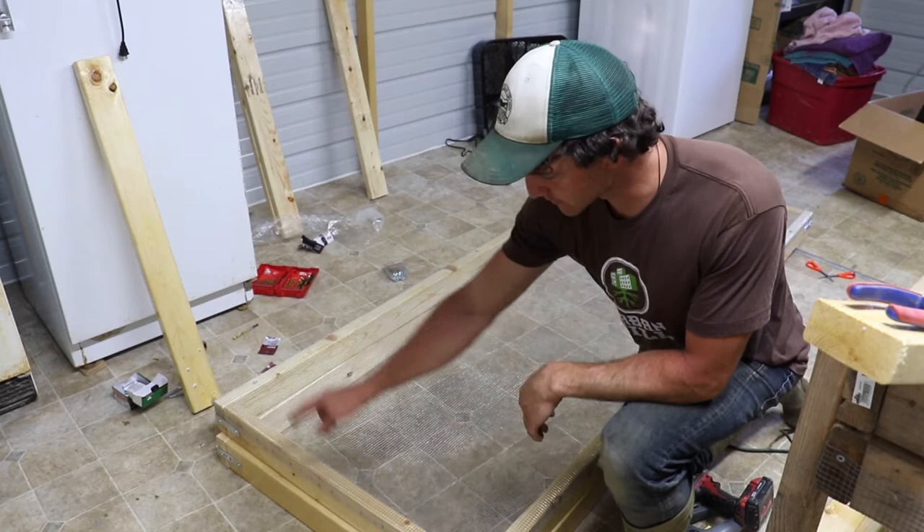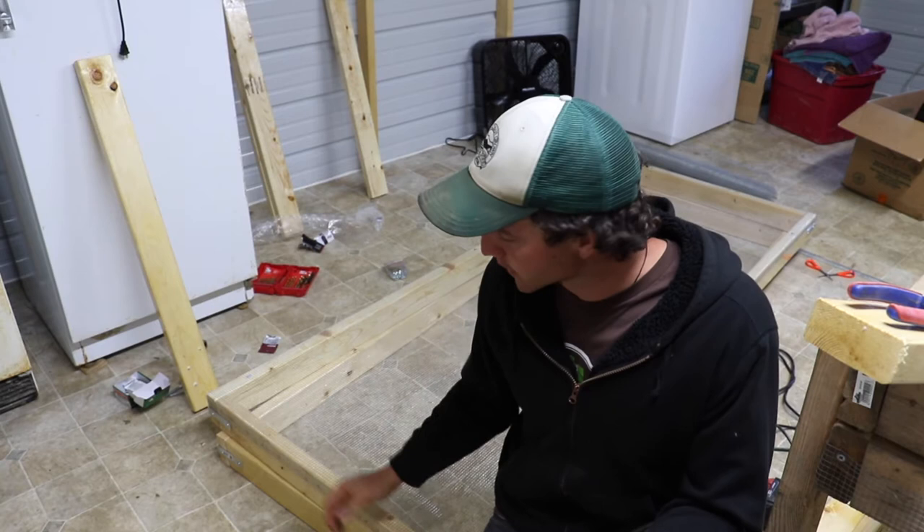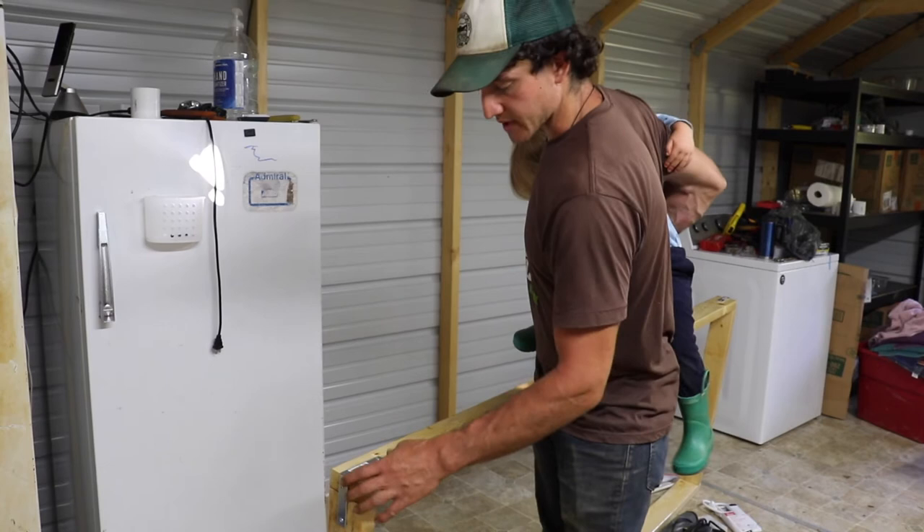Back from dinner and ready to put the legs on. I'm using a quarter-inch drill bit to pre-drill every hole — just makes it a lot easier. I'm using five-sixteenths lag bolts, which makes the thread pretty easy, and then cranking it down with a ratchet. Since we have our brackets on the outside, we're going to put the legs just slightly offset, starting right where the bracket ends.